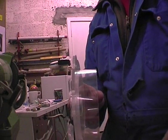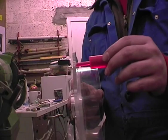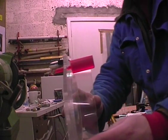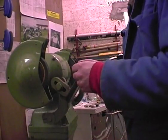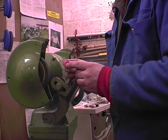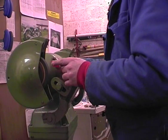It's also worth noting that once the housing fits correctly, the air injector won't fit properly unless the bottom edge is relieved. It's easy to do this — simply take a light cut off it on the grinder.